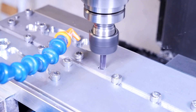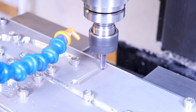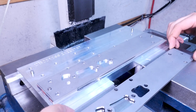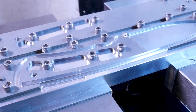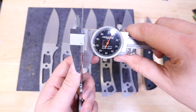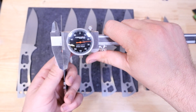With our stock in place we can start the program. We interpolate a little hole in the stock to give ourselves something to plunge into and then start cutting the bevel. When it's done we flip the stock into the second station and load up a new blank in the first. We can now start the CNC program that'll finish the second bevel before getting started on the new blank's first bevel. I really like this two-station system because it means less part changeovers — you can sort of do two knives at the same time without stopping the machine. This is what the knife looks like right off the mill. We've got some hand finishing to do to polish it up but the bulk shape is there and the blade thickness is perfectly even, which I love. It comes out a little under 25 thousandths every time, which will come down to around 20 after hand finishing, and that's perfect for this kind of knife. The blade will be nice and thin and slicey for light duty work like food prep but still strong and beefy enough to get beat through a log and split some firewood.